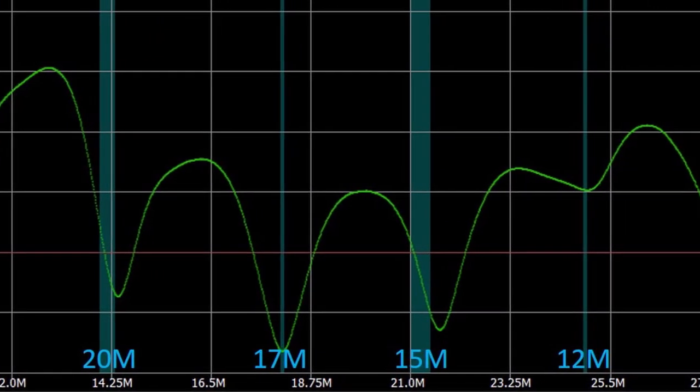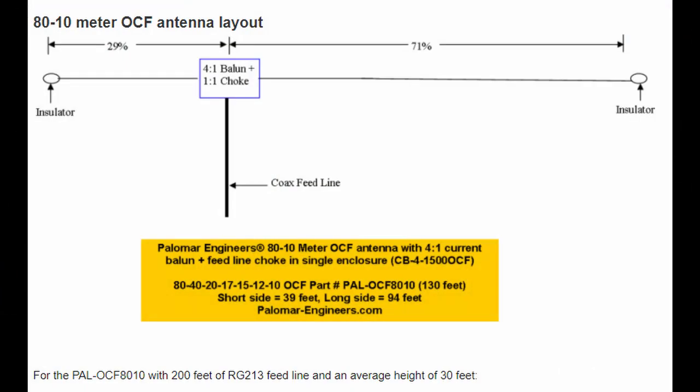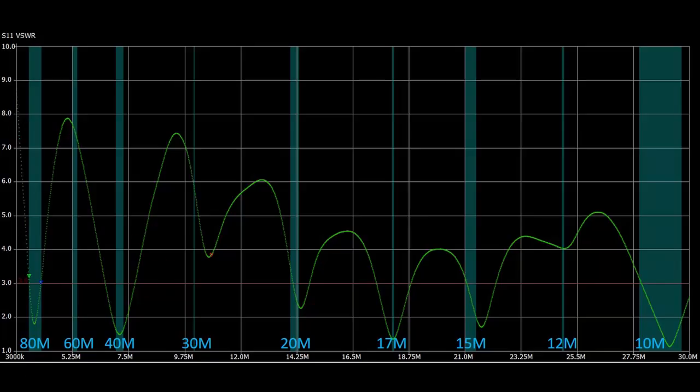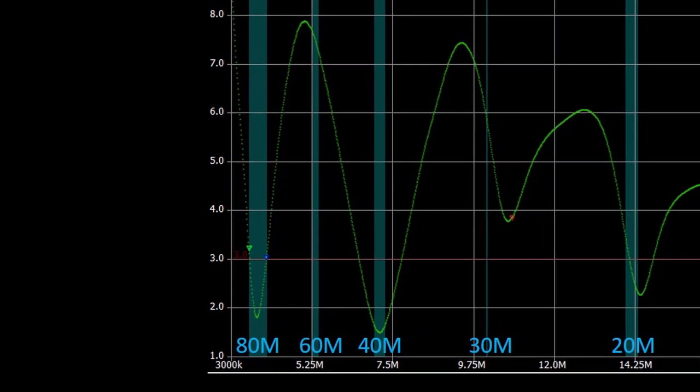What I really like about this antenna is that it has a pretty good SWR for almost all of the HF bands. It's based on dimensions from the Palomar Engineers website — I'll include a link in the description. This red line is at 3 to 1, which is the limit for the 7300 built-in tuner, so that's my benchmark. You can see it's below 3 to 1 for the entire 80 meter band from 3.5 to 4 megahertz; in the middle of the band it should work fine without a tuner. 60 meters doesn't look so good at over 7 to 1 — an external tuner like the MFJ-939 should make it usable, but it probably won't work that great.